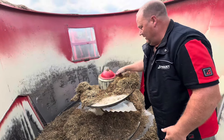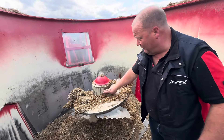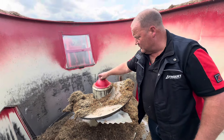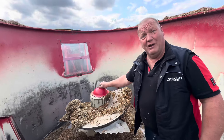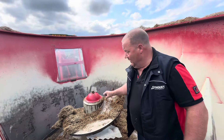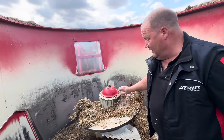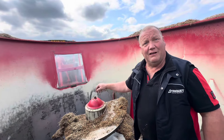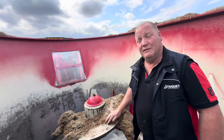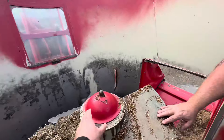When I was talking outside about how the auger is driven — that's where it's driven from. Inside there is a conus bearing and the shaft comes up through. For anyone near the bottom of the gearbox, it's very important to keep that cap in good condition and sealed to the top of the auger, because if silage juice gets down there, that's your bearings and your bush gone. Keep your eye on that, especially if you're dropping in large bales.